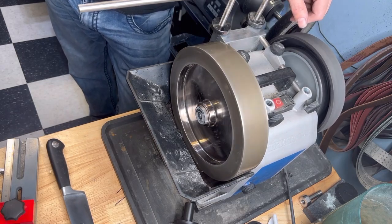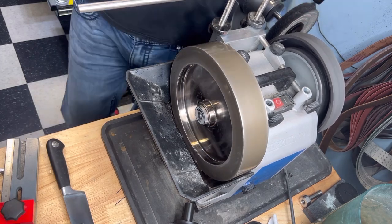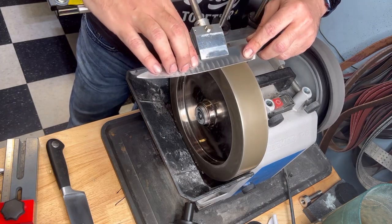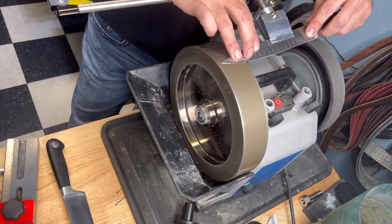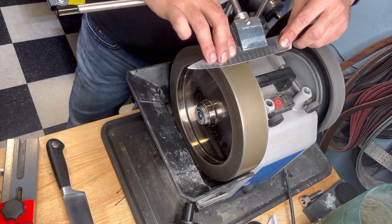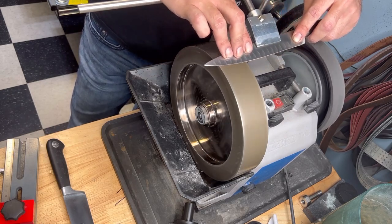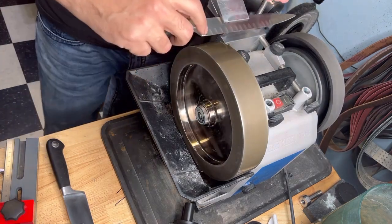And you know, one of the reasons this is taking a little bit longer is because these knives are usually 20-22, and I'm doing it on 19, so I have to remove more material. But I do it on 18 because I know this brand, I know this steel, and I know they work much better on 18 than on 20-22. So, filleting knife. It's a good German brand. The hardness of the steel normally is around 56 to 58. They are mainstream knives, but they last relatively long. That's one of the reasons I like to do it this way.